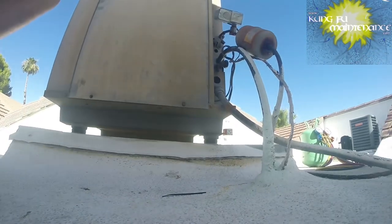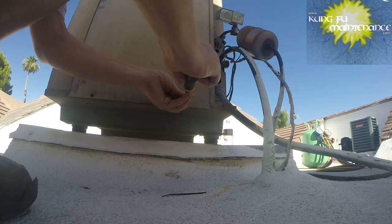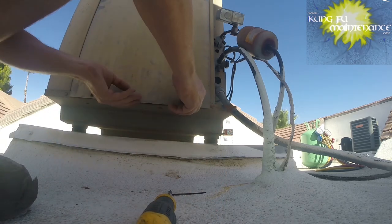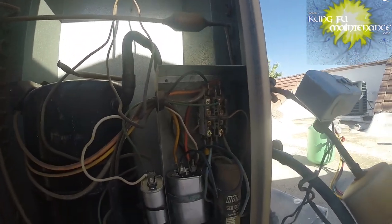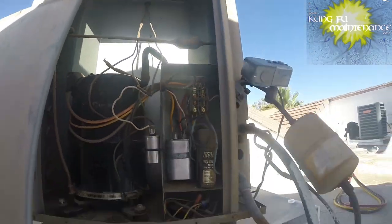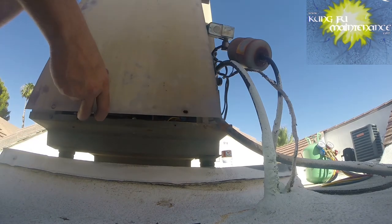Looks like it reached temperature. Everything turned off together. I just wanted to peek at the contactor with all the fun last night. Verify that that's what happened. There it is, but nothing wrong with verifying. Oh yeah. That contactor is funny, when it's sucked in, it still sticks out a considerable amount, so it tricked me last night. Made me think the contactor had turned off.